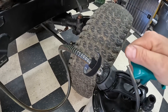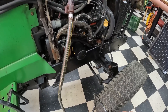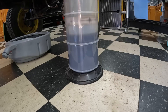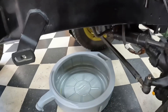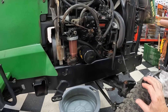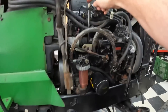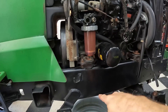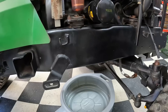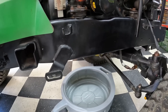I've got it where it's pulling oil now. I'll get that vacuum on the system and just sit back and wait. Got my pan under there — I'm going to go ahead and break that nut loose and drain whatever is remaining. Now, granted, this is the first time I've ever changed oil in this tractor because I just purchased it a week ago, not because I've never done an oil change. When you put that vacuum hose in, you don't really know where it ends up in that pan, so you don't know how much of the oil you're going to get out.